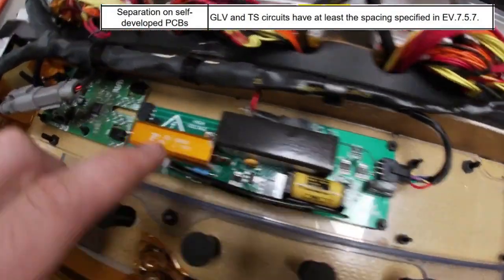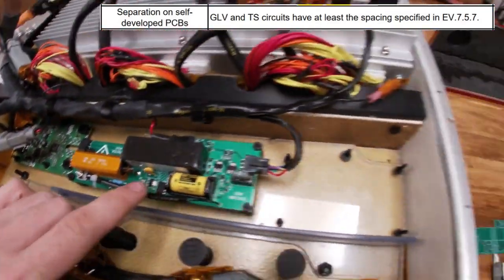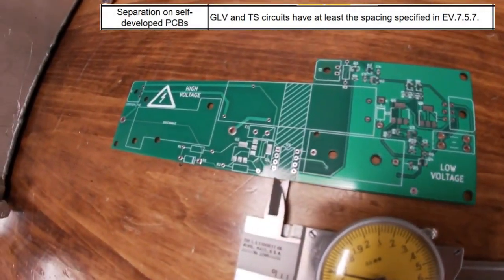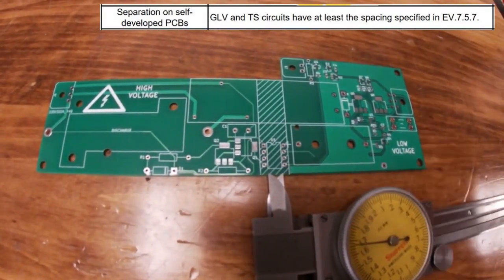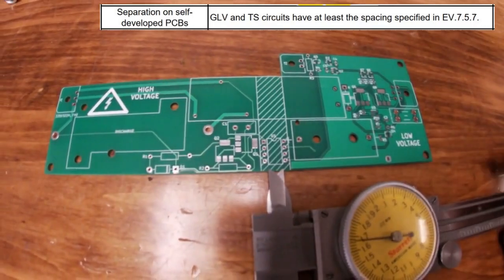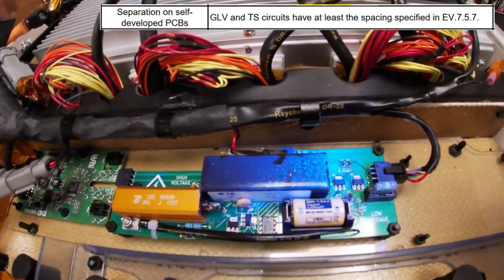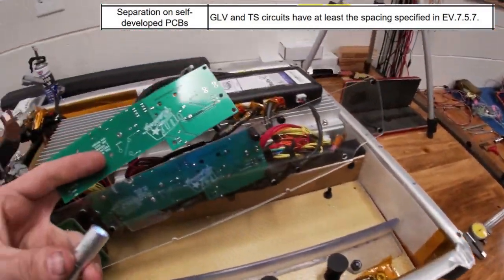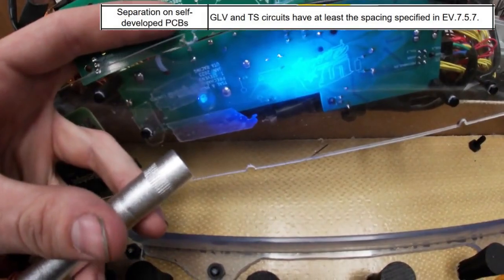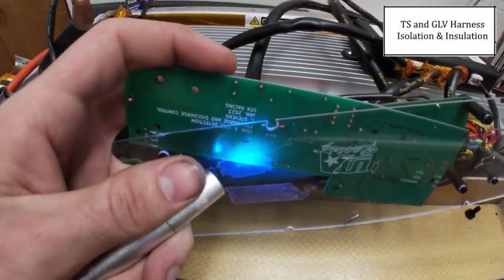This side is low voltage and this side is high voltage, with this crosshatch section being the interface between the two. Over here is the same PCB without the components, and the DIP8 package here is the closest point between the two high voltage and low voltage sides of the PCB. If we measure it, it is six millimeters apart, thus it requires conformal coating. If we go back to the PCB in the accumulator and shine a UV light on the conformal coat, you can see that it fluoresces. On the back side, you can see that it is also conformal coated, and here is the same PCB uncoated for reference.